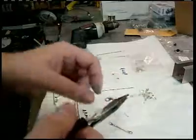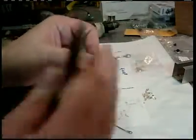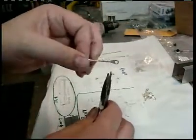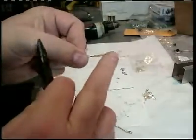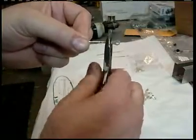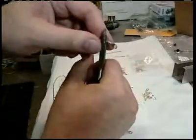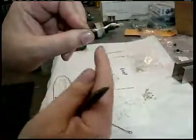And both soldered. And we need to put a bend in these because of the way the body gets narrower at the top, so everything will line up without binding too much. And I believe hold it with the flat side here. If I do it wrong, we'll just rebend it. It's just brass. Just put a little bend in it, and I just move my needle nose right down and put a little bend in it, and end up with a joggle.